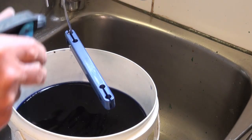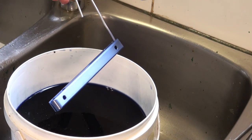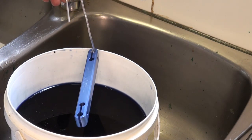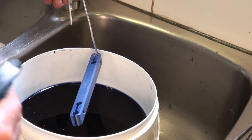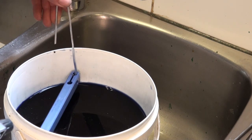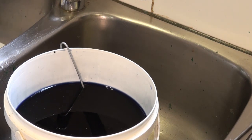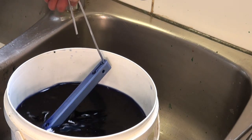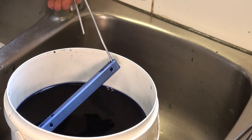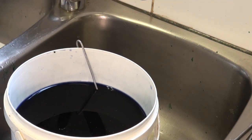That's been five minutes and you can see the blue colouring starting now. You can take it out at any point — the depth of colour depends purely on how long you leave it in the dye bath and how thick your anodised coating was. If you're making more than one part, it's fairly important to match the colours — I've had parts look matched in daylight but then look different under artificial light when seen side by side. With this blue it can go almost black if you leave it in too long. I'll check it every five minutes.